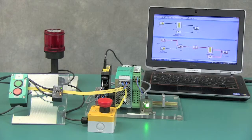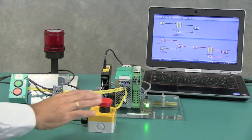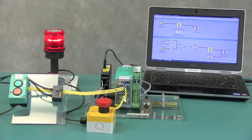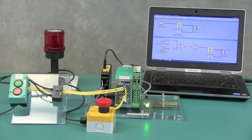Let's see how this looks on the actual hardware. We're starting in a state where the e-stop is released and the safe output is on, indicated by the green LED cluster. Pushing the e-stop deactivates the safe output, and the red stack light comes on. Pulling the e-stop into the release state does not immediately activate the safe output — instead, the green push button LED is flashing, indicating that the button needs to be pushed next. After pushing the green button, the safe output is turned on, the button LED is off, and the red stack light is also off.